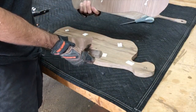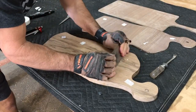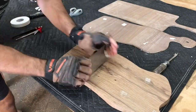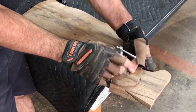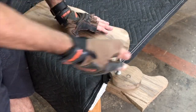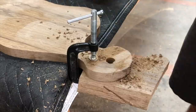The board has been perfectly cut to the template size now — it's the exact same replica. I'm going to take my card scraper and just scrape off the double-sided tape, as it can leave a little sticky or tacky residue. A little tip: when drilling a hole in wood, you want to use a drill block underneath so it doesn't splay the wood or crack it out — it'll just be a perfect hole through and through.